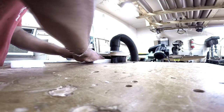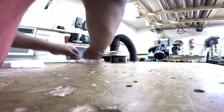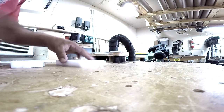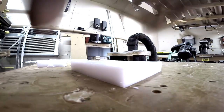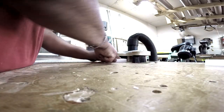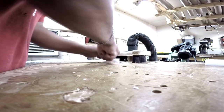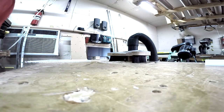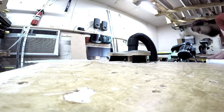Just took them out of the cut, the holding tabs. The holding tabs are those little things right here. This is the method that we use to remove the holding tabs from the pieces that come out of the CNC machine. We just use a standard router with a bearing on the top to guide it along the edge of the piece, and we have the holding tab on the bottom of that portion so it can remove the holding tab completely and leave that edge completely smooth. We also added a brush to contain the chips and a vacuum to evacuate the chips as we're removing these tabs.